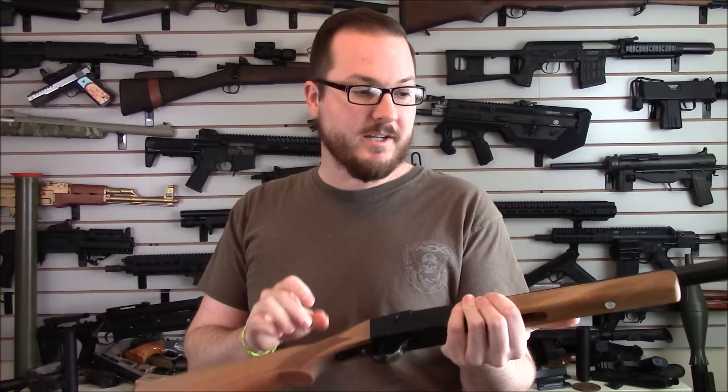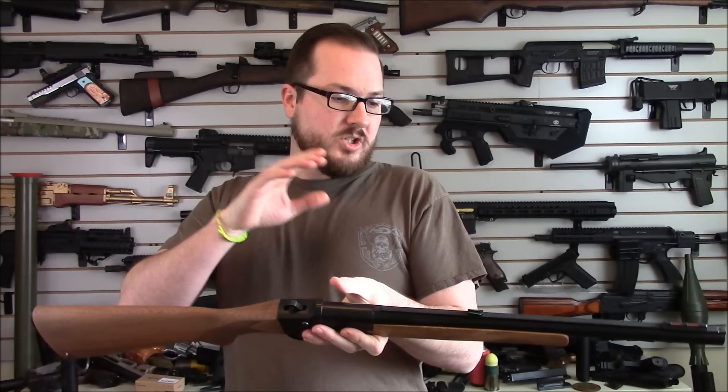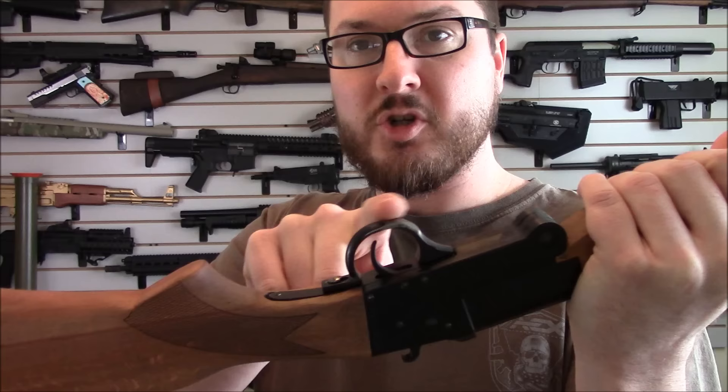Let's talk about the things I've done since my last installment. I cut off about nine inches of barrel, replaced the bead sight with fiber optic sights from TruGlo, and started doing work to get it to fold in half. Originally it would only fold to about here, but now it goes all the way — just a nice little gap of about under a half inch at the bottom.